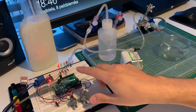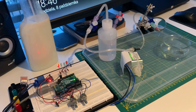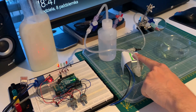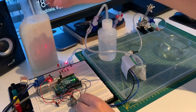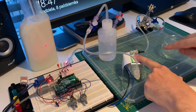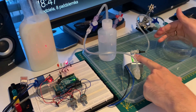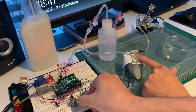There is also a little bit of logic behind the signal levels of the right potentiometer, which I will show in a moment. First, to start operation we need to fill the water circuit, as these pumps do not like running dry. When I move the right potentiometer to the utmost right position it goes into priming mode — highlighted by an LED — and the pump turns on for one second and off for one second repeatedly until all the air bubbles are cleared from the system. You can see we already have a nice jet of water coming from the needle and there are no more bubbles, so let's turn it back off.